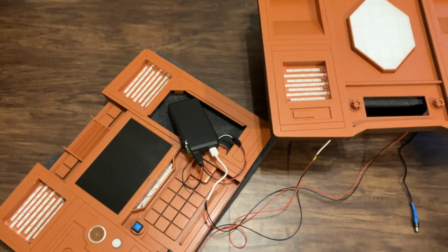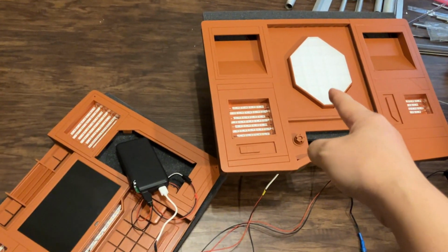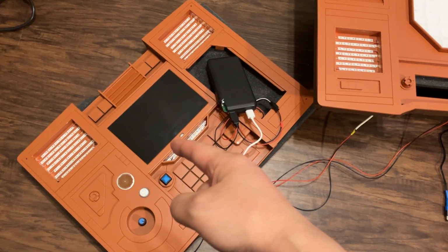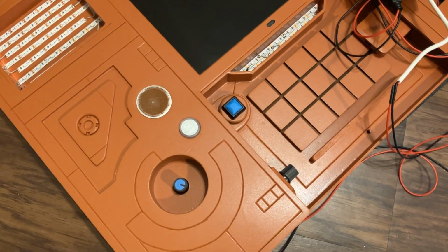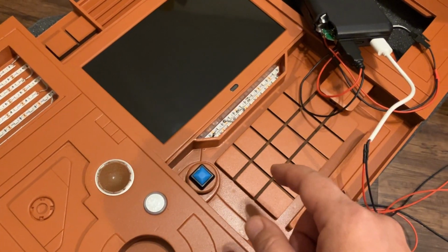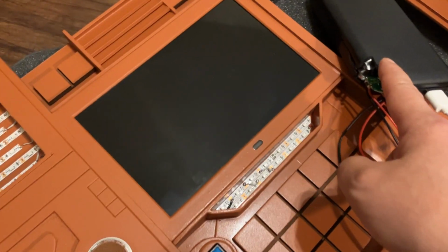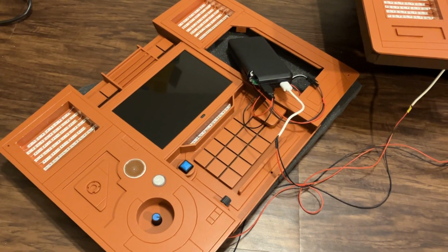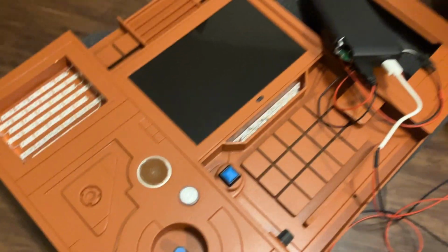Okay, so everything is connected to the battery. There are 2 inputs, and I'm running one for the NeoPixel thumbprint, and the other one is going to be all the LEDs and the monitor. It's going to be everything off the battery. Originally, the switch was a little finicky, so I figured it was a switch bounce thing since there's a tactile switch on here. And generally, push button switches that aren't tactiles don't mix very well with electronics that are designed to be used with a tactile switch. So I put one in here. I'm kind of scared to turn it on because the battery didn't play very nice when I was testing some of the other stuff earlier. So I guess this is the first test of the tactile conversion.